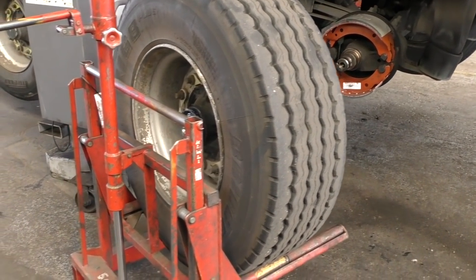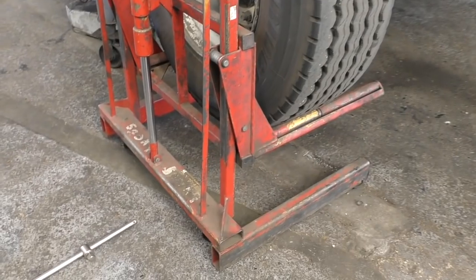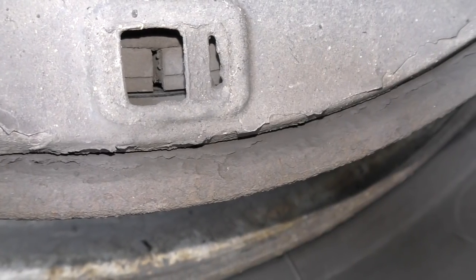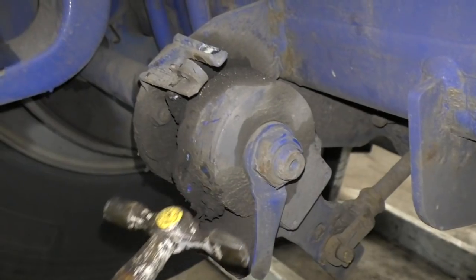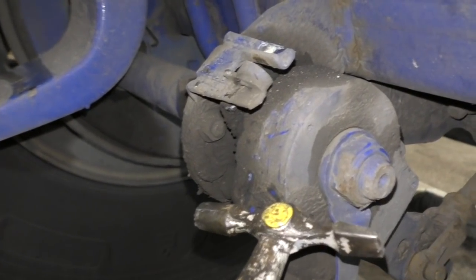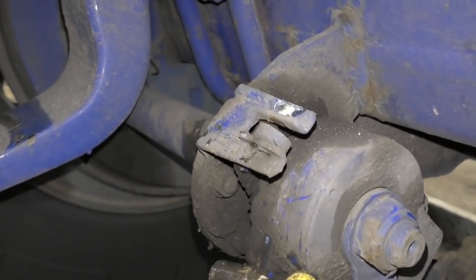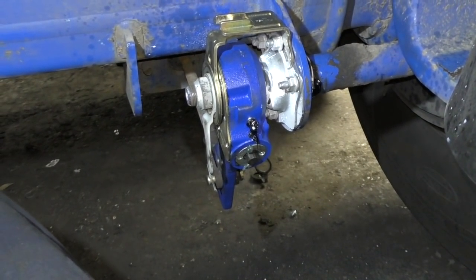I got myself in a little bit of trouble after pulling the hub together with the wheel and everything. Brake linings can be deceptive - as you can see, this one's actually about 2mm and not 5mm as recorded, whereas this one is more like 12mm before the wear limit. This is a slack adjuster - it's attached to a cam. When the brakes wear, it adjusts the slack. This one is actually worn up and needs replacing. Replace the airbag, the cam bushes - which is a bearing bush to support the cam - and on the other side, slack adjuster and cam bushes. Very important components. A clevis pin - a tiny small little bit that should always be free - gives you better braking.